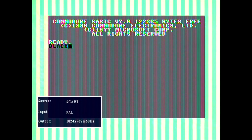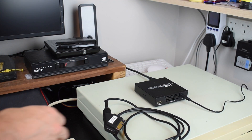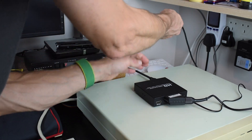The text was very blurry, the colours were unclear, the border had stripes of different colours going through it, the sync kept coming and going, and the converter box kept putting up an annoying status message on the screen. I also tried another converter of the same type but got the same result. I wondered if it was the resistor in the cable — that's there because the voltage level on the chroma is too high for S-Video, as it was set before that became a standard — so I made up another cable without one.